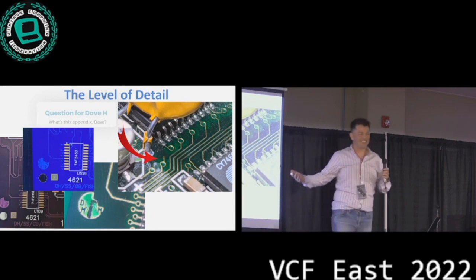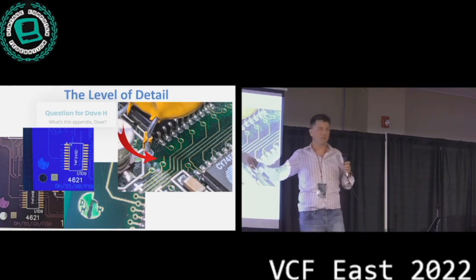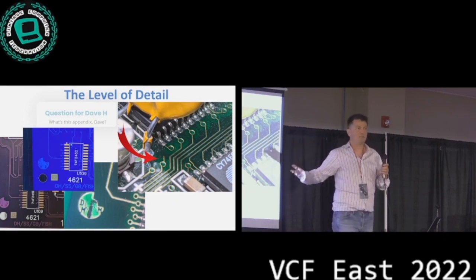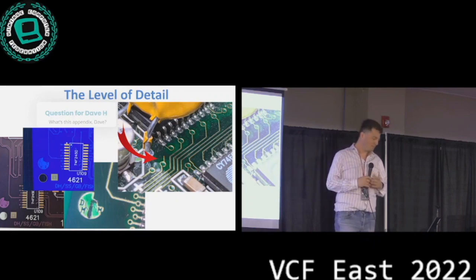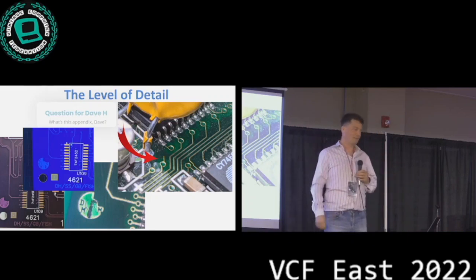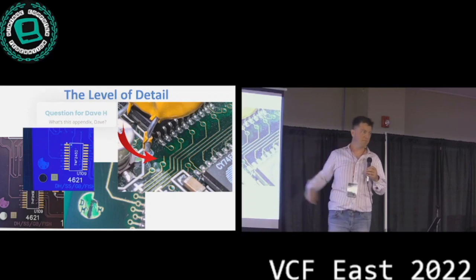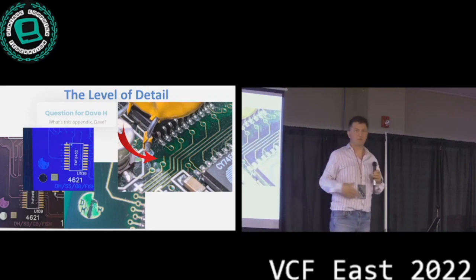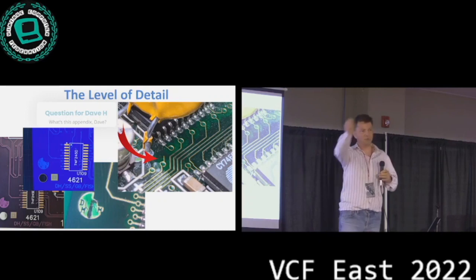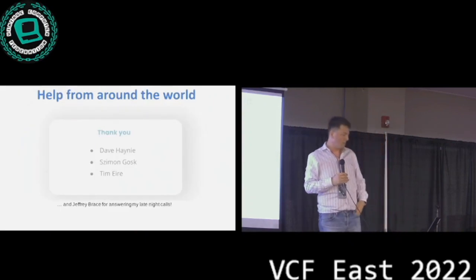I mean, quite frankly, these guys, when they built these boards back in the day, they drew this stuff up by hand, and then they erase parts and redraw it. And at some point, it's like, this is good enough. That's what I'm thinking stuff like this is coming from. But they didn't have all the fancy tools that we have today. So we didn't use an auto router at all because we wanted the routing to be identical. But in theory, if you build something from scratch, obviously you have an auto router available, and stuff like this would not happen, right? You move something around, and it gets rerouted, and everything looks nice all the time.